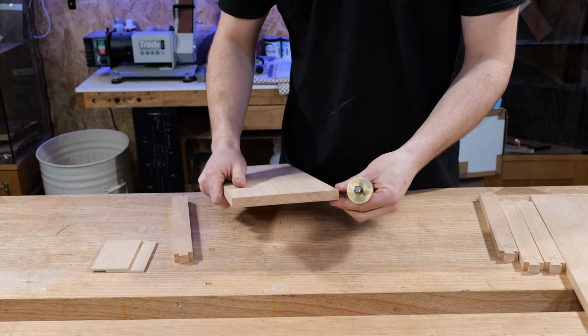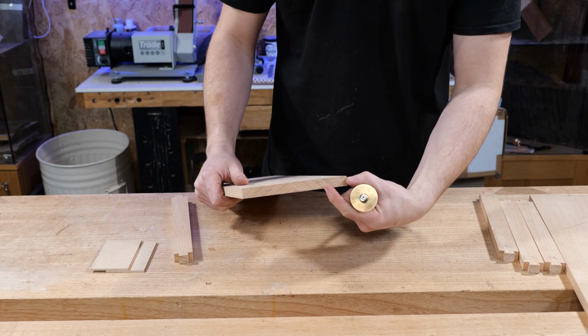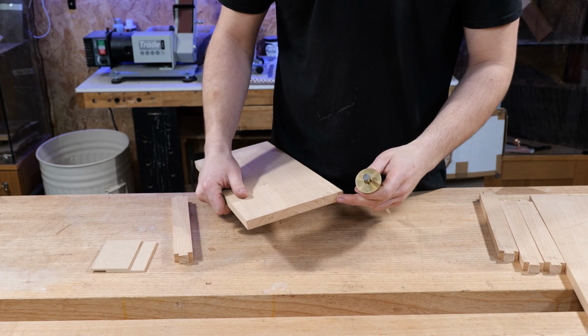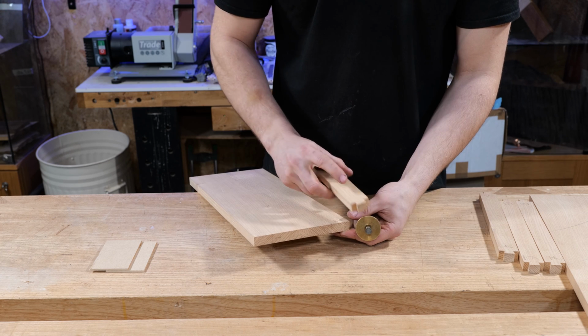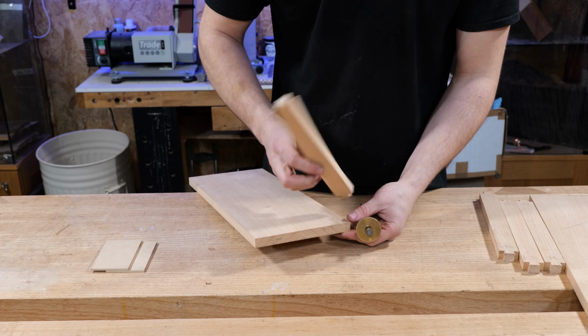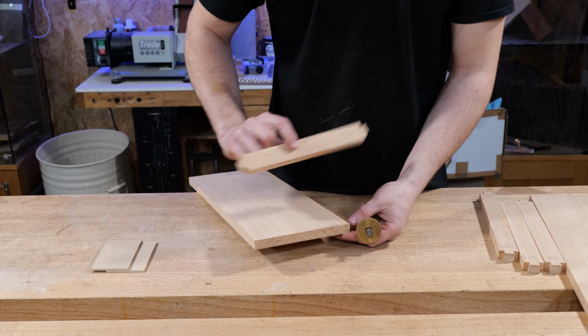We are then going to scratch that on the inside of the cabinet below each of these joints. So remember in the last episode we marked the boundaries for those joints. Make sure that you keep this marking gauge line within those lines. In fact, don't even go up to the edge of it because you run the risk of overshooting it and making it visible beyond the edge of the dovetail, which you don't really want.